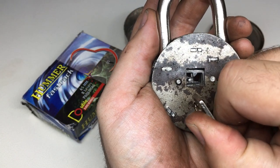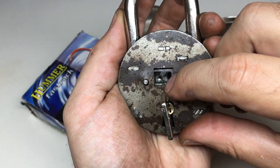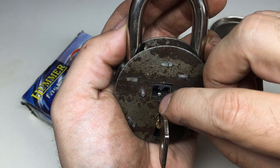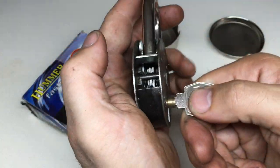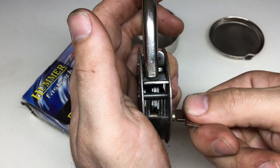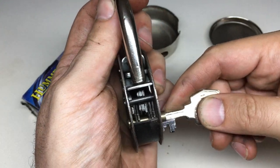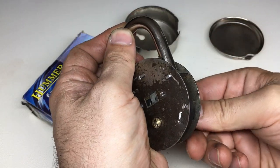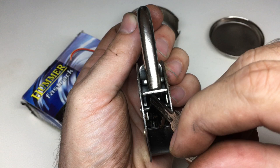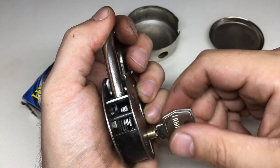You can see there's actually some protection against over-lifting the levers, which is quite interesting. You can see the gate - although it's incredibly wide - actually has a fence on the bottom and the top, which is really more than I expected. So it is a bit better than I thought it was going to be. It is actually double locking at the top. The key goes all the way through to the back, so it is the last position which actually tensions the bolt mechanism - it engages with a talon and slides the whole mechanism back.